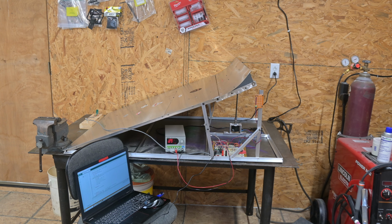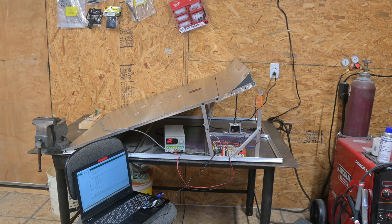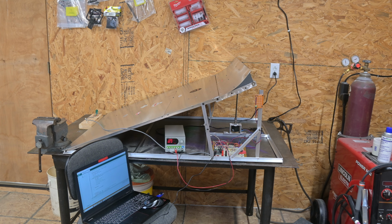And I put the accelerometer in it just because the current microwave Doppler sensor I have in there is omnidirectional, and it's pretty sensitive. I can lower the sensitivity by putting some resistors in the back of it, but I don't want to lower the sensitivity. I want to change the directivity of it. So after Christmas rush, I'm going to order some different sensors that are more directional. But even still, since it is so sensitive and omnidirectional, I didn't want a situation where that kick plate was just cycling back and forth because of false triggers.